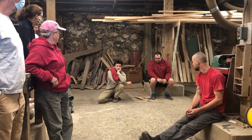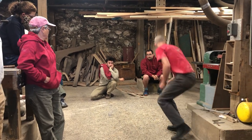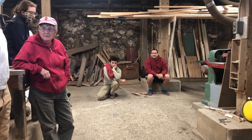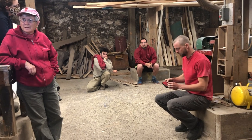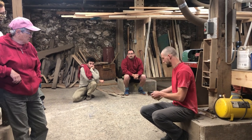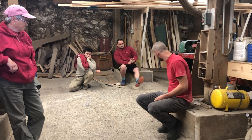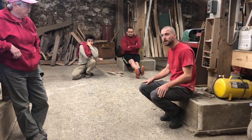More iron-rich stainless steels are more magnetic — stronger ferrous content, less corrosion resistance. Wasn't the DeLorean made out of stainless steel? It was actually aluminum. This 316L has ever so slight magnetic attraction, barely enough to hold it, and the 304 you can kind of feel it lift off your hand a bit.